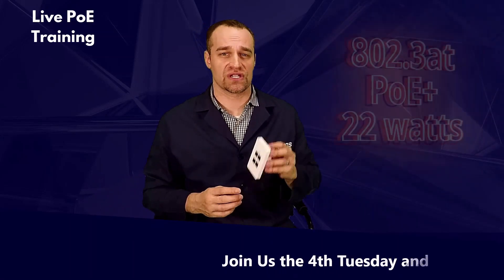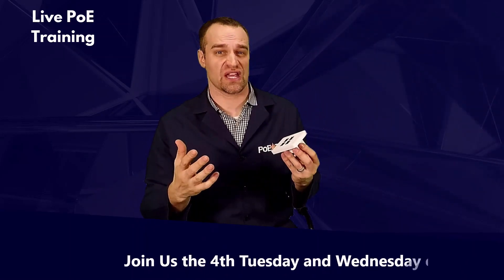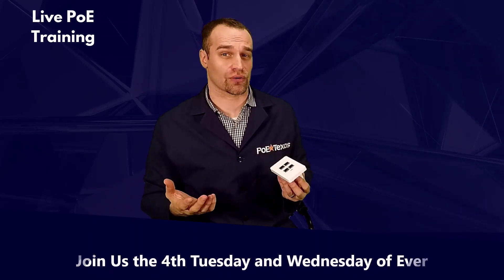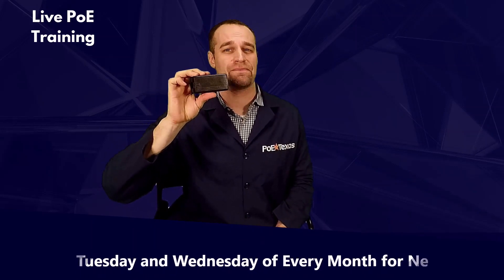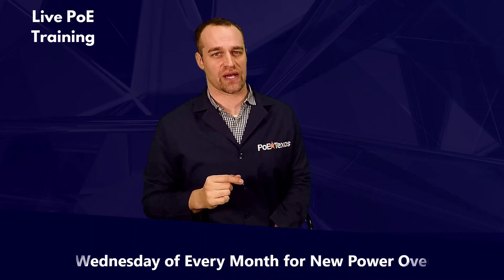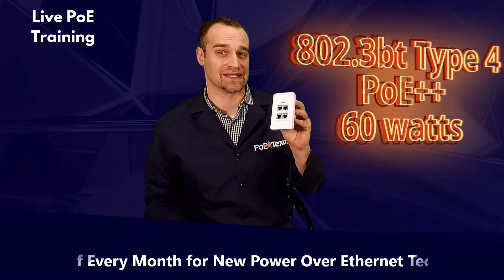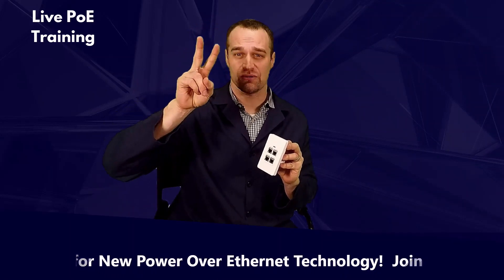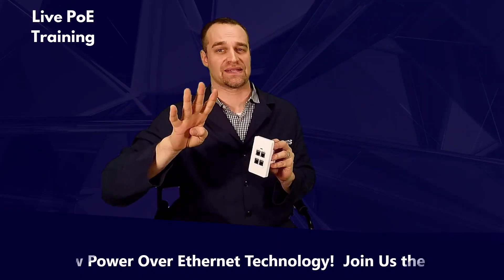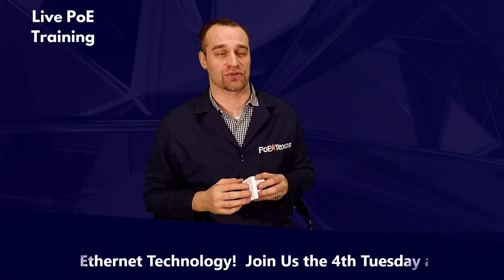If you have PoE Plus, your GBT-4IW will have a 22-watt budget. That means you can plug in three, maybe four IP phones and a computer, or you can add one GAT-USB-C PD to send power and data to your iPad Pro Gen 3 or Surface Go. To get the very most out of your GBT-4IW, you can connect it to IEEE 802.3BT Type 4 PoE and have a full 60-watt PoE budget — that's two PoE Plus devices, or four full-capacity PoE devices. For example, you could use four of our PoE to iPad adapters, all on one cable.